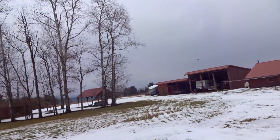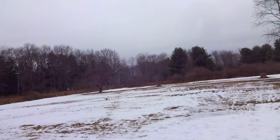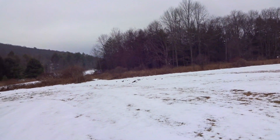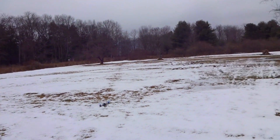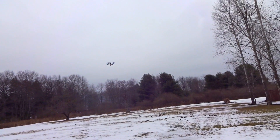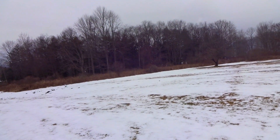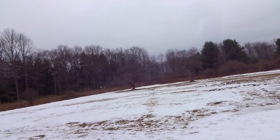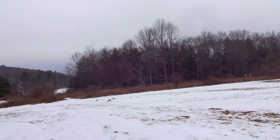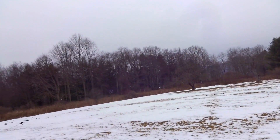There's a little top-end oscillation. I do have dynamic filtering and Betaflight 3.2 on, and I left the notch filters on — I turned those off and actually smoked a motor, so I turned them back on and swapped the motor. It's been doing all right since. Overall the performance is just kind of lacking. On throttle chop punches you can see it's definitely very floaty — the bottom and top end of the motors is just really not there. They're just such a small motor for a 5-inch prop. They're not bad in the mid-range though, and it definitely does change direction very, very quickly.